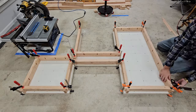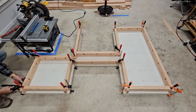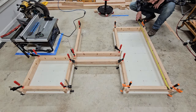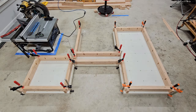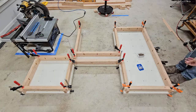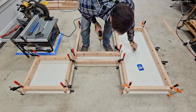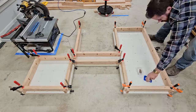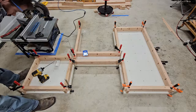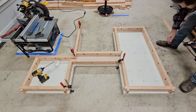I grab another one of my squares and set it up like a depth gauge, measuring for the three-quarter inch standoff for the overhang of the tabletop which I've designed into this piece. I went all around and checked all our alignment, and everything came within about one sixteenth of an inch. Our tolerance for this project is about a sixteenth of an inch — we could probably chase it down to a thirty-second or less, but at some point you have to decide what is good enough, what is satisfactory and effective for the amount of time you're going to spend putting it together and using it.